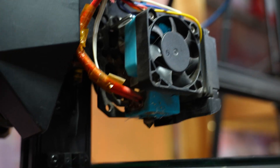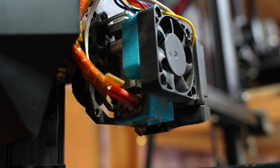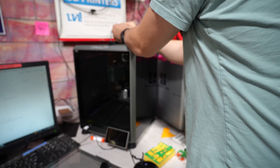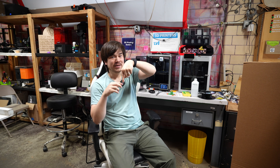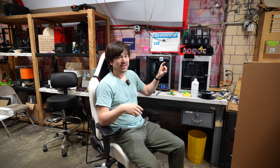In a situation like this you're definitely going to want something like this AMS unit that has a full enclosure for your filament. This also has a lot of downstream effects — if a printer doesn't have the best heat break, a nozzle clog can cause the heat break to fail, where the filament sits in one spot for a long time, the extruder wheels grind without feeding properly, and eventually heat creep works its way up and seizes the plastic inside the heat sink. In the case of the Creality K1C, they've moved to their unicorn-style nozzle which has the heat break integrated into the nozzle assembly — so when you remove and replace that nozzle, you're basically throwing the clog away.